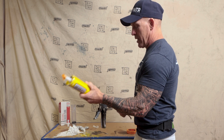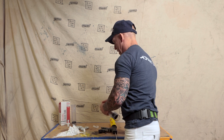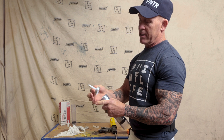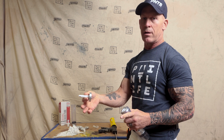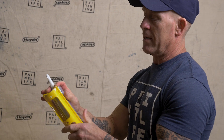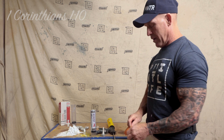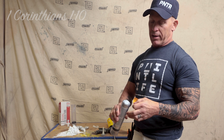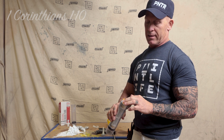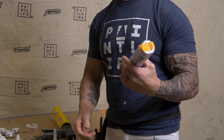Another thing you can do is take your tube out — this is what I typically do. Take your cap and tip out and drop them into some warm water, and that's going to keep them from drying out. When you come back the next day, just stick your cap back on, put it back inside your gun, and you're ready to start caulking again. If you don't want to waste a tube of caulking, you can also just take a piece of tape and stick that over the end of your sausage pack to keep the end from drying out as well.